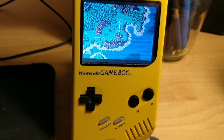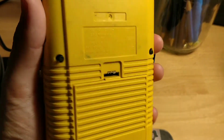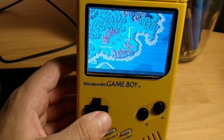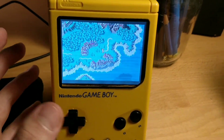What I opted to do instead was to just put two buttons on the back with little tack switches, and then actually map those to X and Y, because I find you don't use the shoulder buttons all that much in a lot of Super Nintendo games — besides Street Fighter and maybe a couple others. But you can usually get by without them.